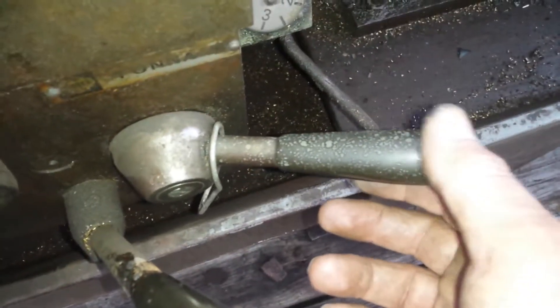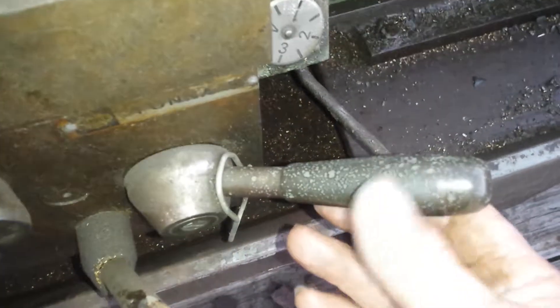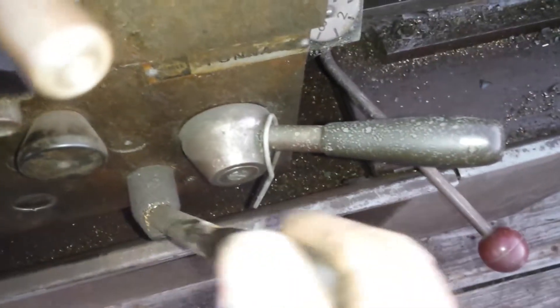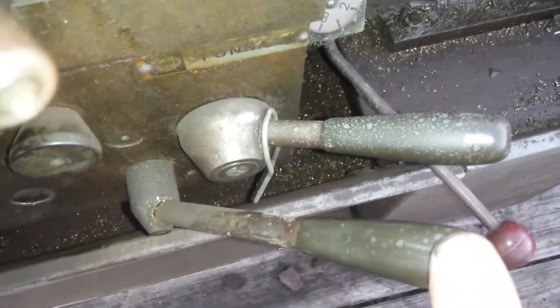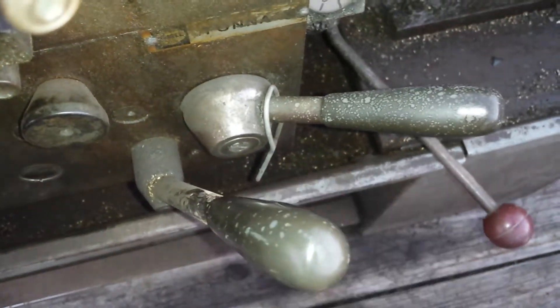This half nut lever — this thing will go all the way down straight down, which I'm sure it's not supposed to do. It will not stay up. It feels like it can't go where it needs to be. This feed lever is supposed to engage and stay there, and it doesn't. I don't know if it's a detent problem, a travel problem, or a combination of both.